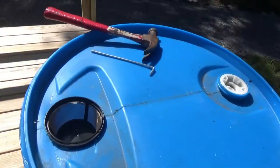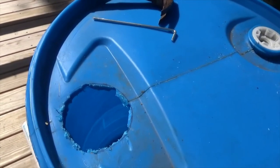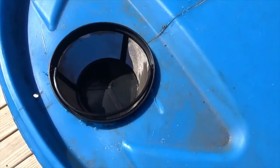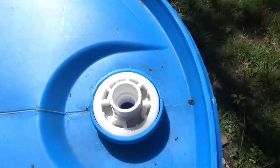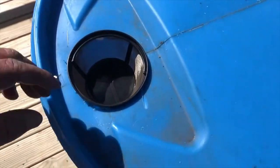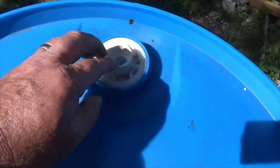I was working on the rain barrels. You can see the rough cut — I should have used a jigsaw but I didn't bring it. I got this reusable coffee filter that I'm going to use; it fits in there pretty good and will filter out any debris. I also took this bung out — the one with the buttress threads — and took the knockout out of it. I only did it on one because you don't really need a vent on the other since you have this opening. Everything is going to fill from the bottom up, so when it drains it will have a vent here and I'll put some screen over that.